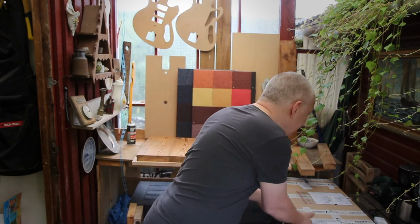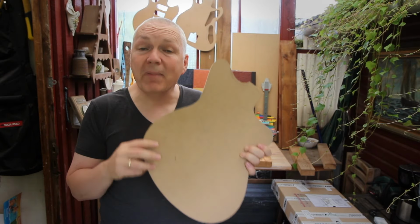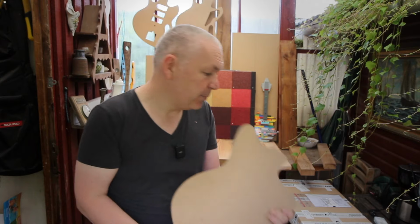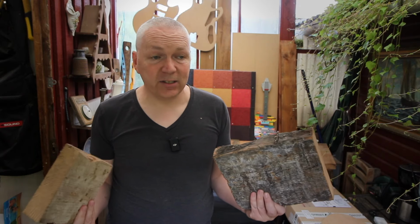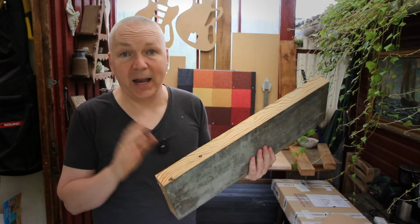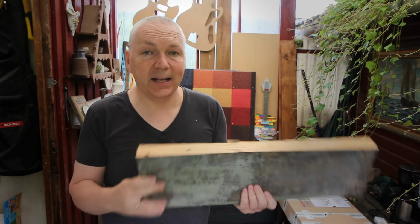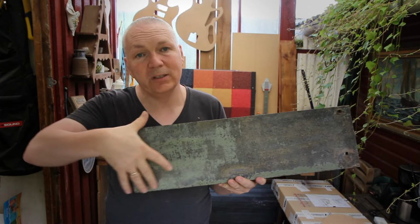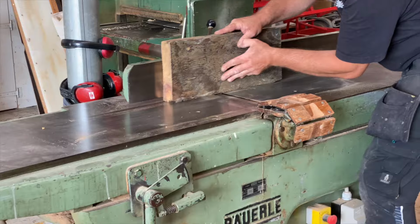For all of you who don't appreciate this old wood, I'm going to use this one over here. This is a little surprise, and I'm going to get into that just in a second and show you what that is. So this is 37 centimeters wide. So to make a body blank where I can cut out this shape, I need to glue two pieces of wood together like this. And that presents its own challenges because this side of the wood has to be totally straight. So I tried to straighten it out by hand, and it didn't work. When one thing was straight, the other thing was not. And I tried and I tried until this piece actually it's not wide enough anymore. So I had to go to a professional, and he had the right machines. He ran it through his machines, took 10 minutes.